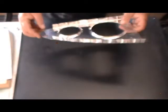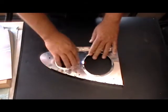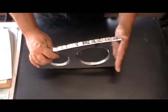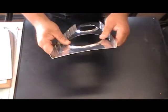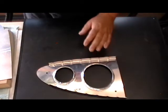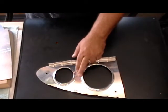What I'm going to show you in this video is how I make a nose rib. A nose rib is this — this is a completed nose rib, well 99% done. When it's completely finished there will be a vertical stiffener riveted in here and a vertical 90-degree attach point so I can attach this to the spar. You'll notice there's a bit of a bow in it and when those 90s get riveted in the bow comes out. The whole gist of the project is to manufacture 44 identical ribs just like this one.